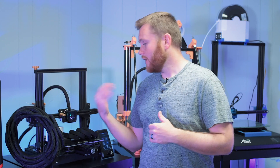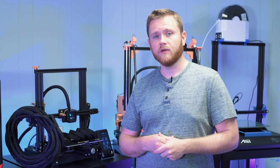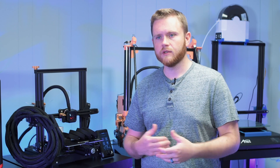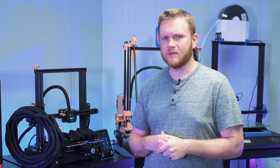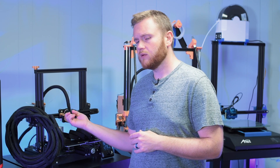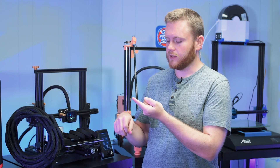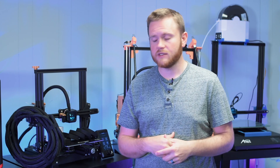The only other thing you're going to need is a 3D printed bracket that I found on Thingiverse. There are brackets that the CR Touch comes with that do work, but some require you to drill holes and some only use one piece of hardware instead of two. I wanted something cleaner, so I got my own M3 nuts so that the hardware on the mount isn't upside down. That way you just hold a nut on the bottom, put the screw in from the top, and everything looks nice and clean for the install.